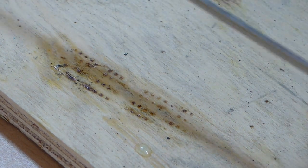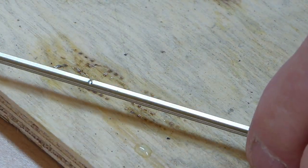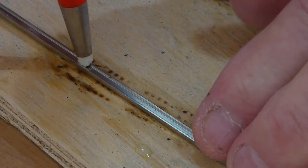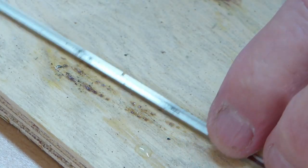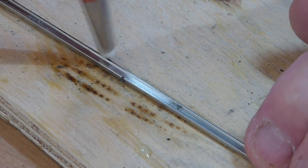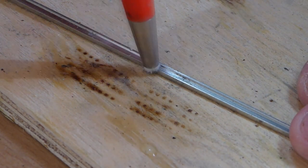We're going to apply our tinned fish plates, one either side, to our rail, which we've got the saw mark in the top of. So what we need to do there is clean the rail. Get our scratch brush in there again. Give it a good clean, both sides. You get a little bit of residue from the fiberglass needles breaking up as you clean, but as you can see, you get it nice and shiny, because if it ain't shiny, it ain't going to solder, no way.